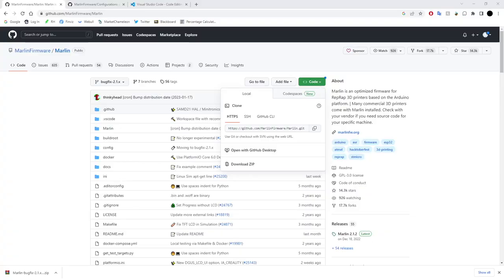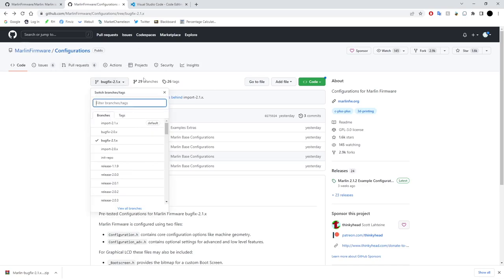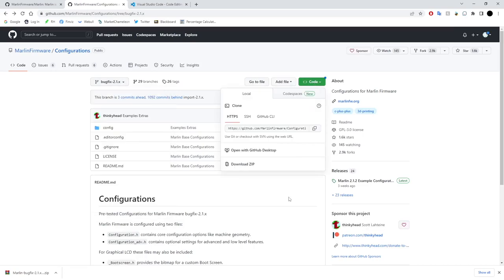So now for the software, first thing you need, Marlin 2.1 bugfix. Go to the GitHub, it's in the description. Just click code, download zip, it'll download right there if you're on Chrome. Then you're going to need configurations, the pre-made configurations, also linked. Make sure you're on the correct version that you're doing this for. So we're doing bugfix 2.1, so we're going to select that. Download zip,